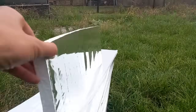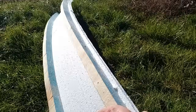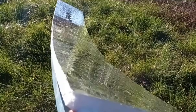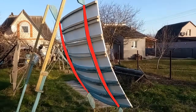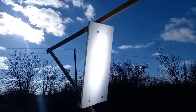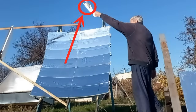These structures use the same cylindrical mirrors, but they are mounted on wooden ribs which form the desired shape of the mirrors. I assembled seven such mirror strips into this structure. The edges of those wooden ribs rest on curved surfaces, and therefore those seven mirror strips focus the solar radiation into a single spot, where I will place this piece of newspaper.